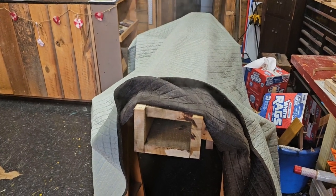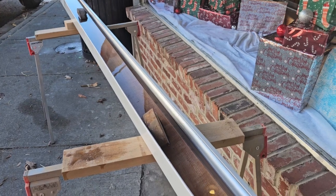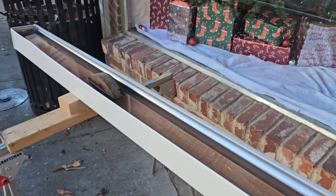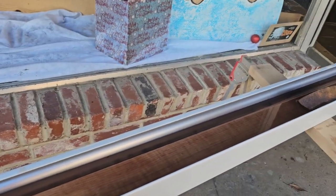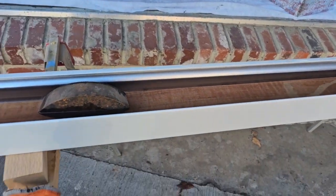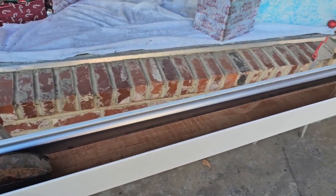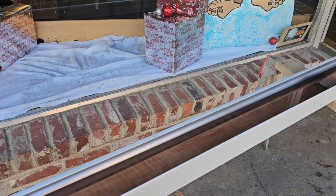Okay, so I've had this steam box going about 2 hours. It is plenty hot. Just uncovered it, took the door out. We're getting ready to put the pieces in. I've been holding the sides down in the water with this pair of old irons. We're going to take one piece out and let the other piece float in there, and we're going to try to do this. Now, one thing that's really important is gloves, safety. This stuff is steaming hot, pun intended, and we're going to do this safely.